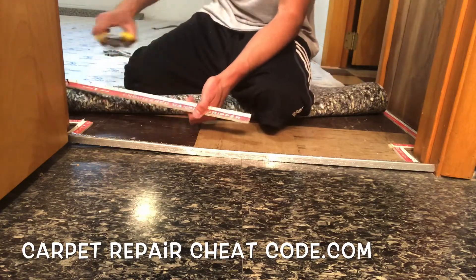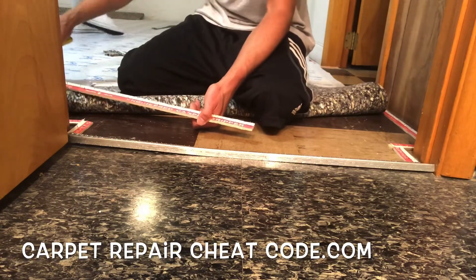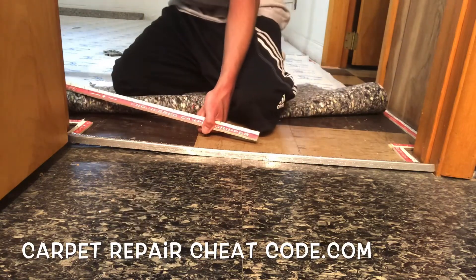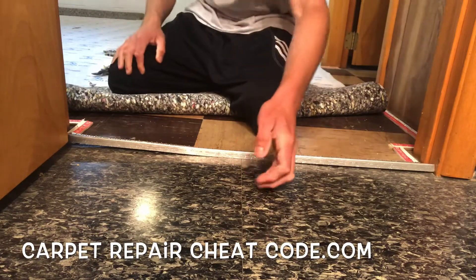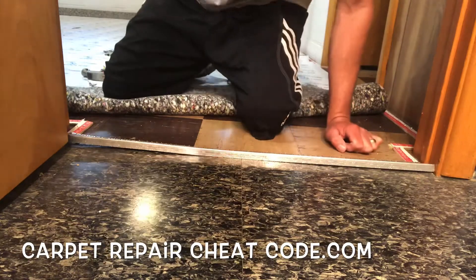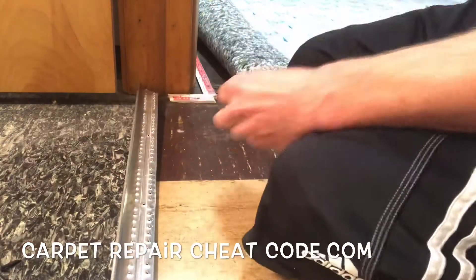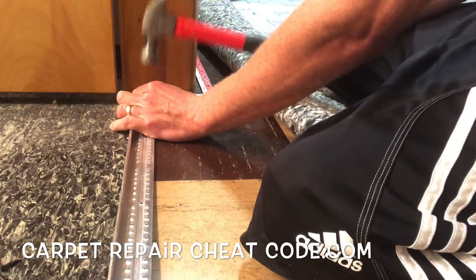We're going to pull nails directly out of the tack strip. Why would we be so wasteful buying a bag of concrete nails? We love stimulating the economy. We'll pull them right out of the tack strip and use those to set our nails. What kind of nails are these? They are 11/16" concrete pins. We're using these because we're going through some asbestos tile on here and then nailing into the concrete, so we need them a little longer to get through that tile and grab into the concrete and hold it nice and strong.